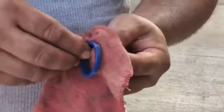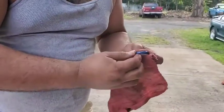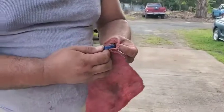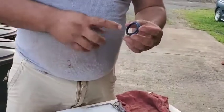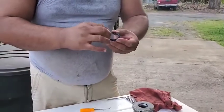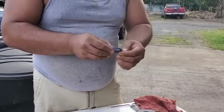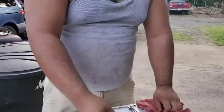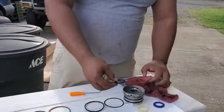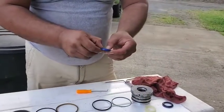So this is our wiper seal. Let's wipe it off and take a look. This is basically what keeps all the dirt and crud from getting into the cylinder. This lip right here is getting a little stiff — it's still a little bit pliable but it's starting to harden, as happens with age. Here's our new one — it's softer.